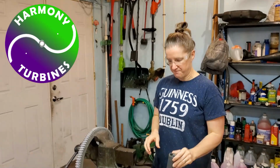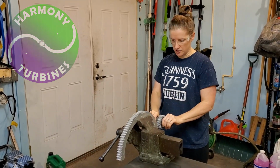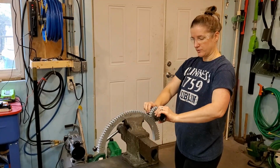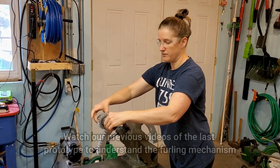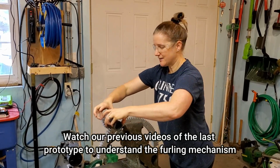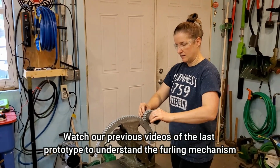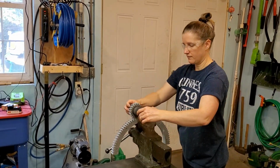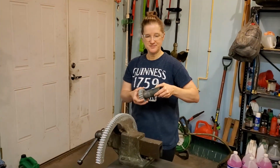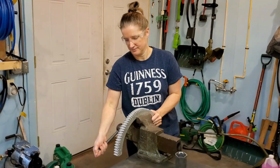Alright, thanks, babe. So I wanted to see, if he was pushing really hard and it's going smooth, that's really different than just a real light push going through, if the wind is just blowing lightly and we're just unfurling and furling, how much pressure you need to make this move. And I'm pinky holding, and it's perfect. That's all I wanted to test. Now remember, the gears are not going to be moving as it's spinning. The only time they're moving is when I'm furling and unfurling. 99% of the time, they're going to be sitting still, just static, holding. The big thing that I need to find is really strong, powerful worm gear, worm wheel assemblies for the bottom, because that's what's going to be holding the torque back for the scoop array.